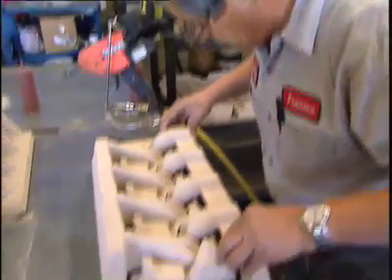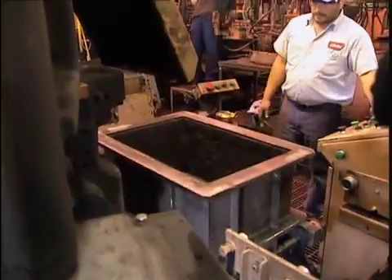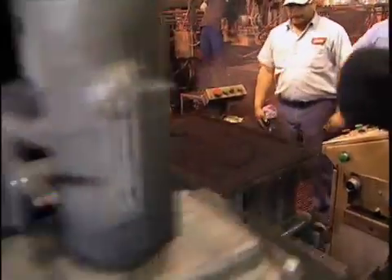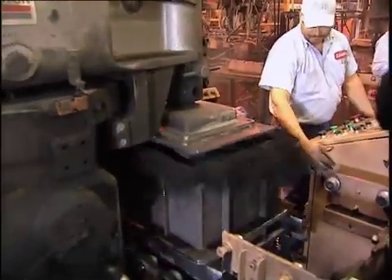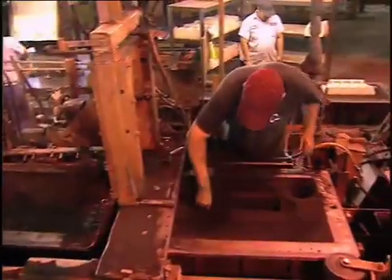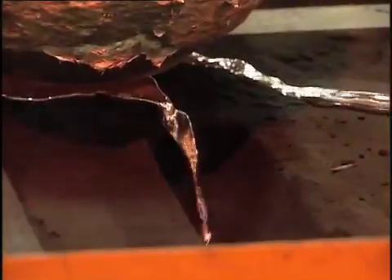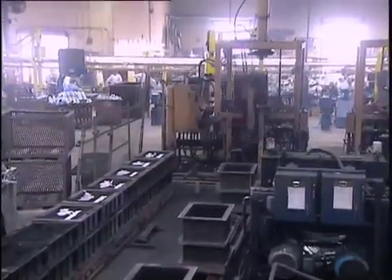When all gets done, it's ready to pour. The bottom half of the mold is called the drag. It's filled with black sand and packed before the completed slab core goes into place. The top half of the mold is called the cope, and it gets drilled for a filling hole and also a riser. With the two halves joined, a ladle full of hot aluminum is robotically poured in. After the aluminum solidifies, the flask goes to the shakeout station, where the now-loosened core sand gets dumped out.